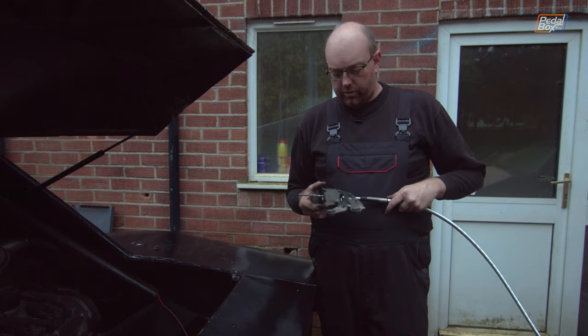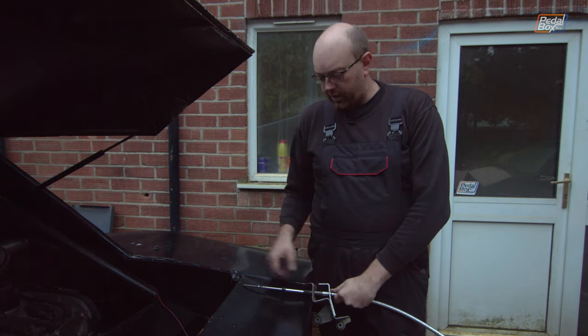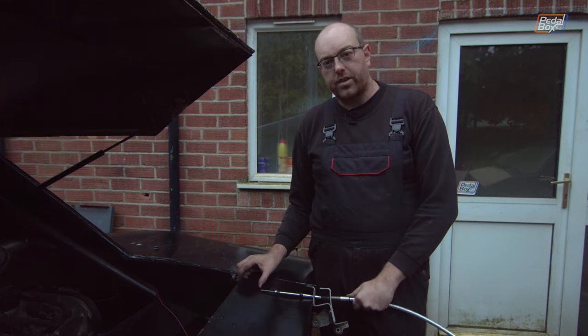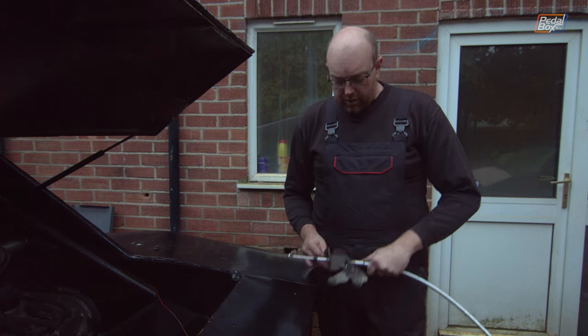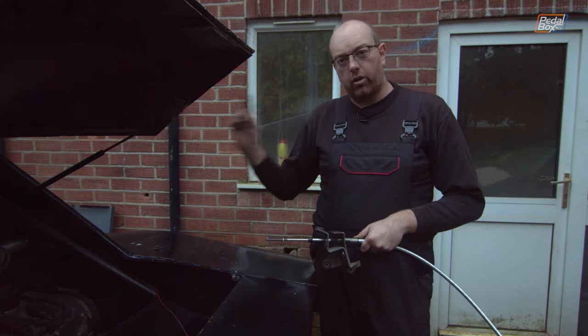And you see, if it goes through like this and mounts all the way through here, it sticks quite a long way through the back. You can see it just measuring off the back of the car. Whereas if we're going through this section and we mount it to there, we save ourselves a good 2.5, maybe 2 inches, so 50, 60 mil. So we're going to thread this into place, put it on, and hopefully we'll be able to move the tower with the gear stick. Not going to thread it all the way to the front yet.